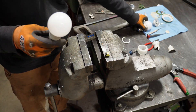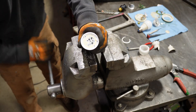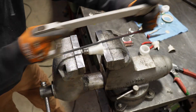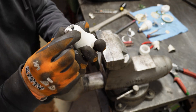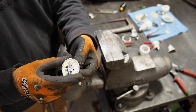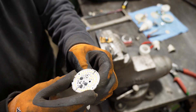Let's do the same on the 100 watt equivalent — let's just break this off. Better mounted than the other one. The light board is a lot busier. Look at the difference — these are both EcoSmarts. Got the same pin — actually this one doesn't have a pin, it's just a soldered wire. All the guts are on the main board and there's a lot less to it. It has one capacitor that I broke loose, compared to the other one that had a whole bunch of capacitors and that little transformer. This one only has one big capacitor.